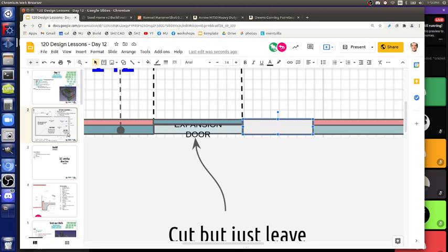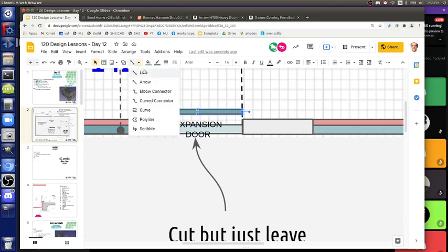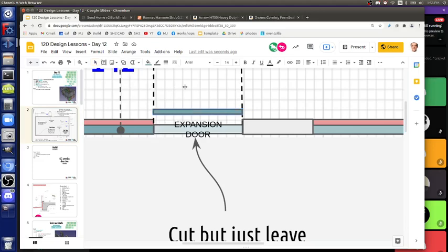That detail applies to all the door openings. But the pink is insulation. No, we cut it out. We got no foundation underneath the pink right now. There is no foundation under the pink. So the blue, the expansion door that you're drawing, is not resting on the foundation. It's nailed into the foundation with Ramset, from the side. Okay. So the nails go in like this.